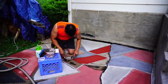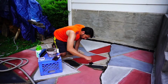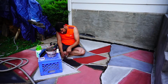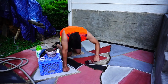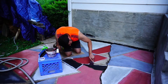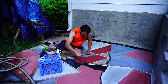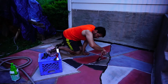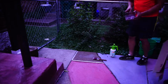It's actually hard. Each patch should be made with only one prep of the concrete, because somehow each batch looks just a little bit different in color, so it won't really look right if you have half of it done with one batch of concrete and another half done with another batch. It's not really a problem because, as you see here, I'm doing pretty small patches at a time. I'm doing approximately 2 cups of concrete per batch.